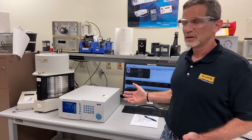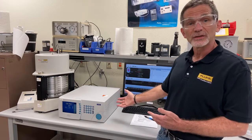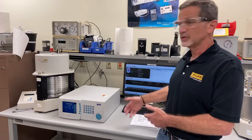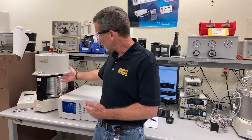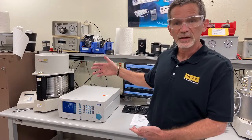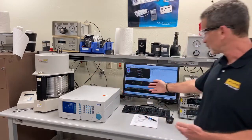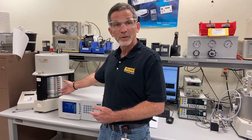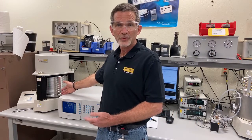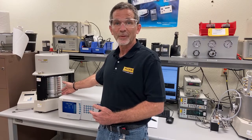There's no reason why we couldn't calibrate multiple instruments at a time if there were multiple instruments of the same pressure range. As you may have seen while we were talking, previously all the masses were unloaded. When we went to the next pressure point, which is 180 PSI, the mass was adjusted so that the one mass needed to generate or measure 180 PSI loaded automatically.